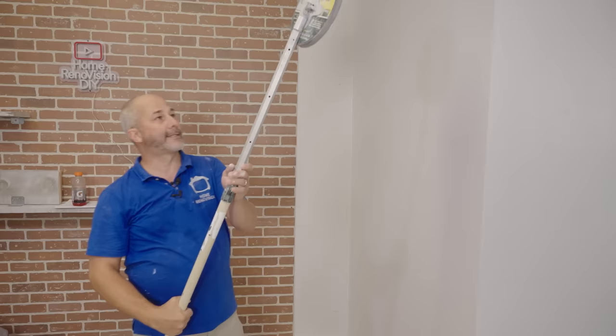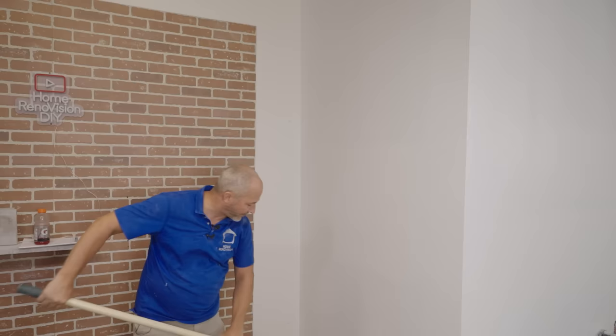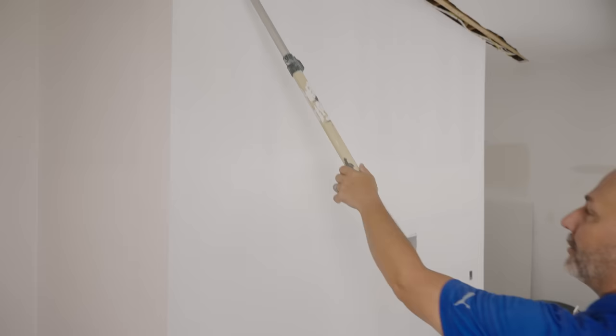And you're going for basically sanding all the flat areas. We're just looking for debris at this point. There's always a little bit of dust when you sand, and we're not really looking to sand down the dust that was trapped in the paint, because that becomes part of the paint when you paint. But we are looking for chunks of debris, things in the atmosphere, animal hair flying around. But more importantly, sometimes you open a used paint can, you're gonna have little chunks of dried paint in it. And if you get those on your finished surface, that casts a shadow.